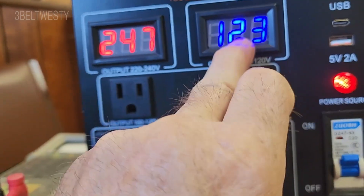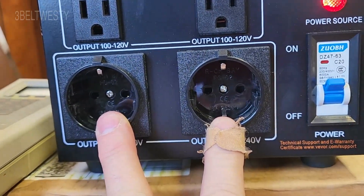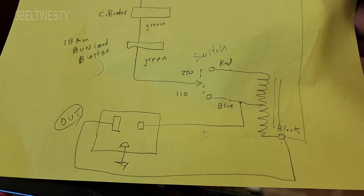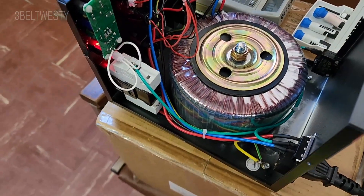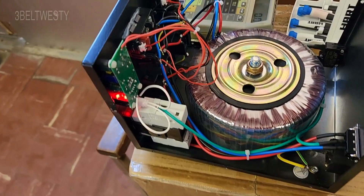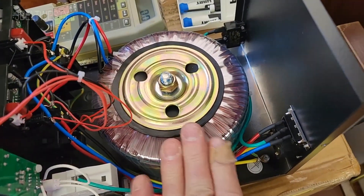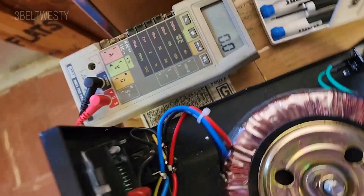Right now this is the line and this is auto transformer transformation that's two times higher. It's got a USB on it. I've got a couple of these to play around with, so I wanted to see sort of what's going on here. That's not an isolation transformer. That's 2,000 volt amperes — for continuous it's 80%, so it'd be 1,600 watts at a power factor of one. I'm going to turn this off. Something like this will probably take about an hour to warm up.